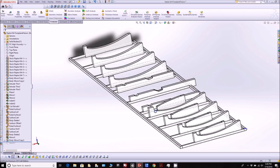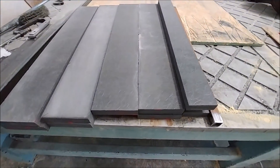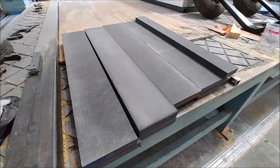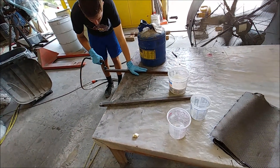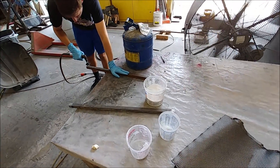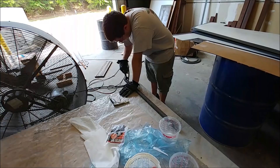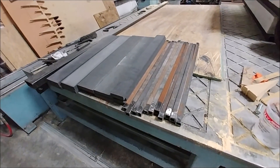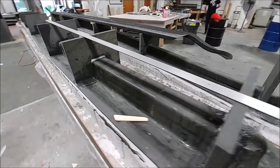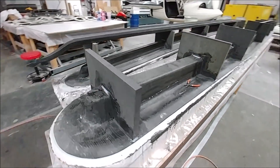The support pieces will be carbon or glass, milled out with the CNC machine. The guys have already cut the boards — eight of the taller ones and three shorter ones for the center. They're cleaning off the ends of the steel, using one-by-one steel again for this, in preparation for welding up the whole framework, probably tomorrow. All the cross pieces are now ready to be welded. The stands have been leveled and will be run on the machine to get the edges perfectly flat.